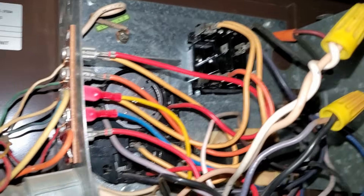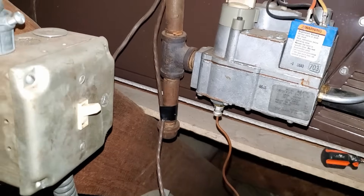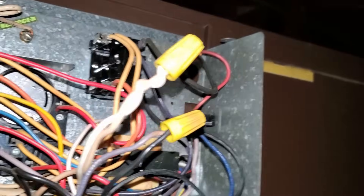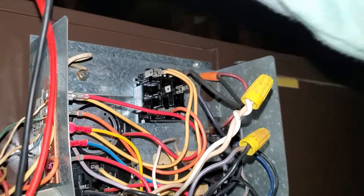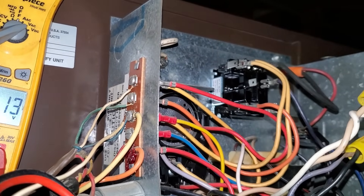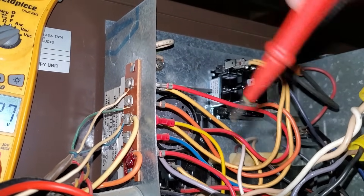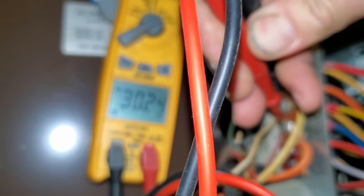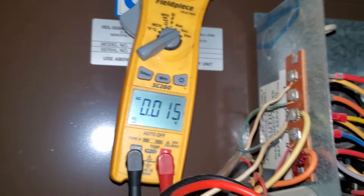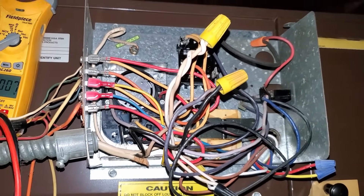That's going to be one of the more important and easier troubleshooting steps before you necessarily look into what's actually happening at the equipment. Now that we're here, I'll show you that we have voltage at our thermostat terminals. The terminals are exterior on this particular one — normally they'll be mounted on your control board or something similar. We're going to check between the R and the common, which is typically the red wire and the blue wire. Testing in volts AC, you can see that we do have 30 volts showing right there. Normally it'll be closer to 28 volts, but 30 is still fine. So we're getting proper voltage coming out of our unit and we know that we have power to this system.